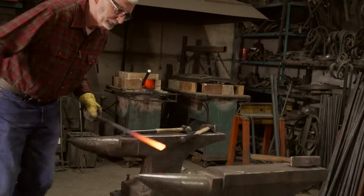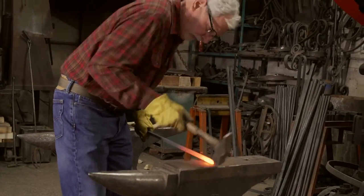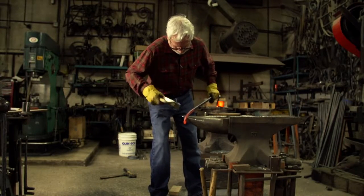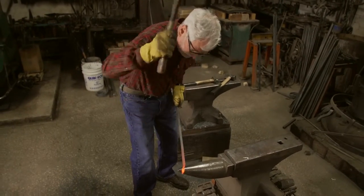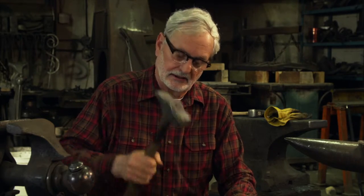There are lots of ways to swing a hammer. If you swing a hammer all day long and you hold it in a clenched fist, you're going to develop shoulder problems and elbow problems. Those problems come from the transfer of energy — hitting steel sends energy through the handle up into your arm. When you're really going to hit something hard, reaching up to the sky and coming down as hard as you can, it's a different grip. It's no longer a clenched fist.